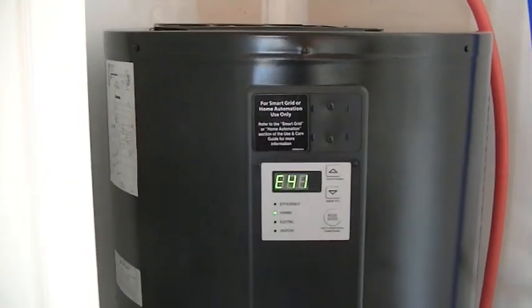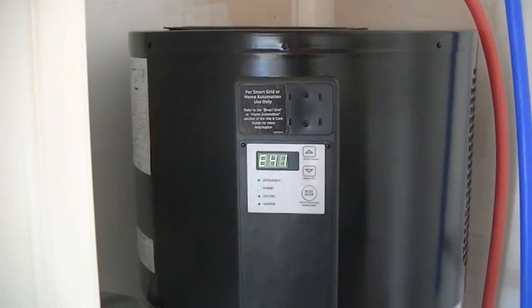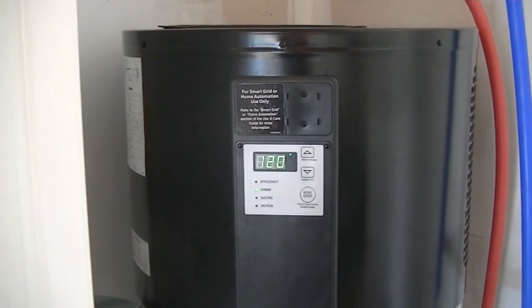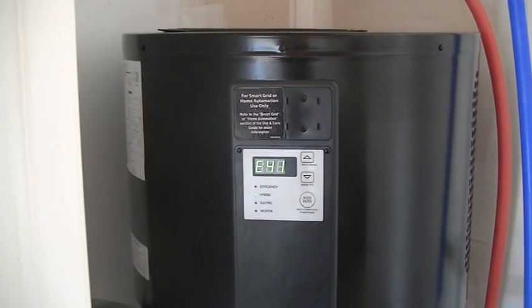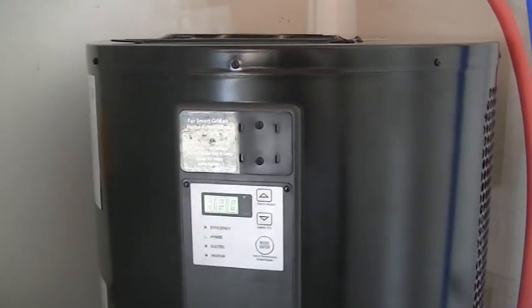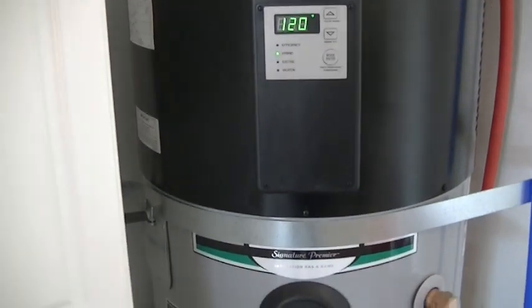And it's super efficient. A heat pump compressor on the smaller units uses 5 amps. This one here is a bigger unit, and it's about 12 amps in electrical use, but it's quick. It's a lot faster than the 5 amp pump. But it transfers the heat and does a really good job of heating water.